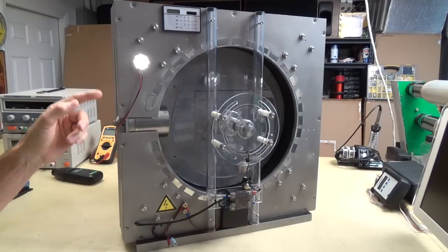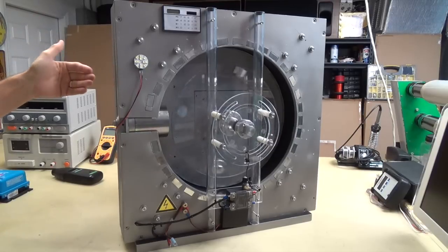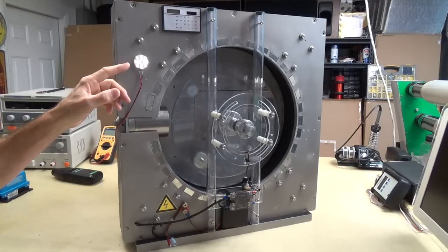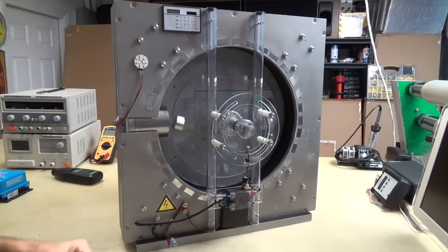There's no capacitor on it to smooth that out, to hold a little bit of power in between the phases that it's showing you right now. These are the 3 phases, and it's a 1 2 3, 1 2 3, 1 2 3, and so that's why it's pulsating like that. Obviously, capacitors just smooth that out right away.